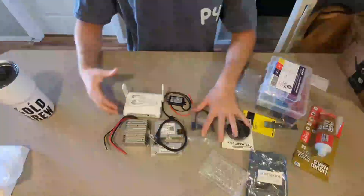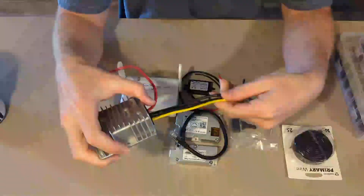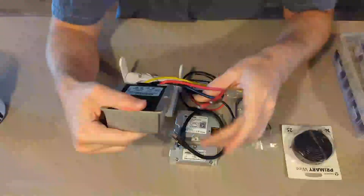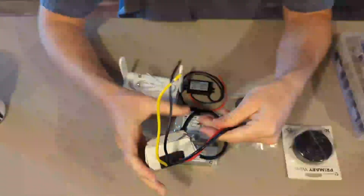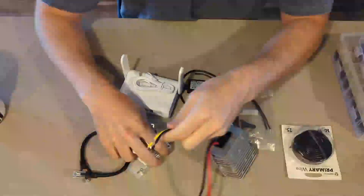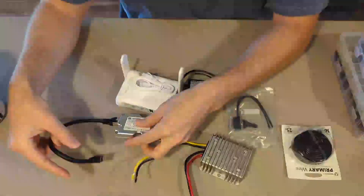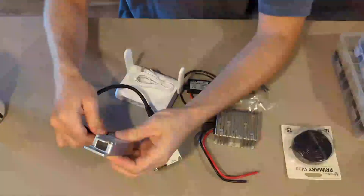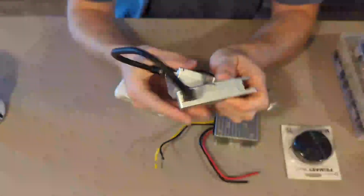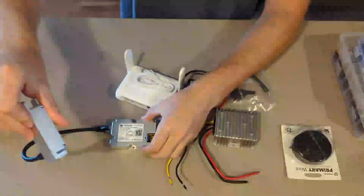Those are the parts. Let's get started. I haven't bought the board yet because I wanted to lay it out and see how compact I can get this. So: 12-volt input, 48-volt output. The 48-volt output is going to feed this PoE converter, the plus and minus, and that will directly connect into this adapter. So this is LAN, and this is the power — going here to here. The Starlink Dishy will plug directly into this, so I want it to be easily accessible.